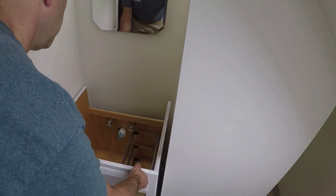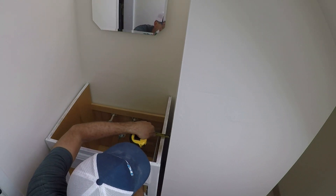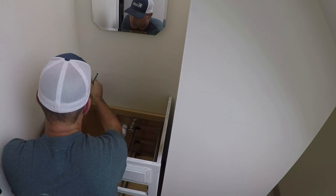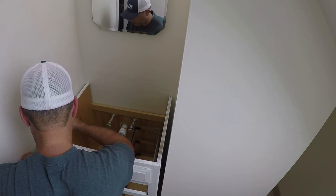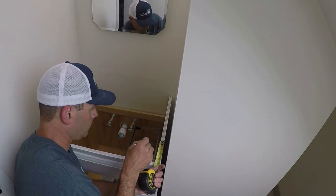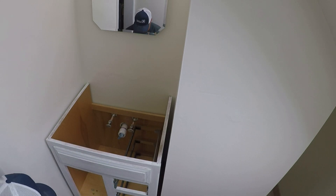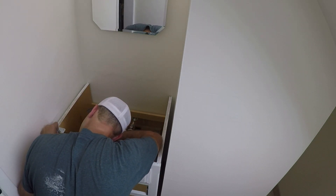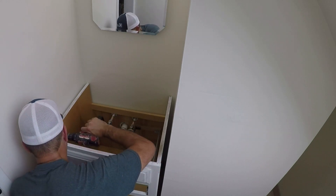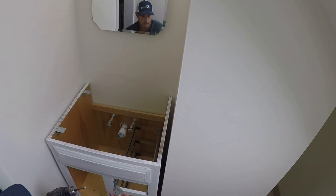In this case I had a single sink vanity. I'm just measuring the vanity and locating it — it's going to get screwed into the wall through that piece of wood against the back, right above the plumbing valves. I mark off two inches from either end on the sides because I'm going to put some angle brackets so I can mount my plywood to something. If you have granite or stone you'd just use silicone caulking and glue your piece of stone down. I'm going to use plywood, so there's my first angle bracket — it's just a Simpson strong-tie right angle bracket. I'll put one in every corner, and that gives me something to screw the plywood into.